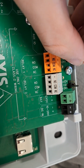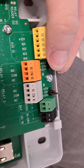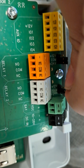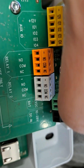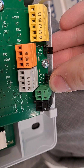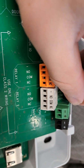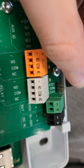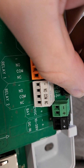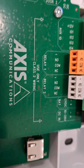We're using all of our strikes at 24 volts, so we're going to connect this accordingly. We take the jumper out and put it on 24. If I wanted 12 volts I would just put it on 12 like this. So now it's on 24 and we just have to mount this up top.